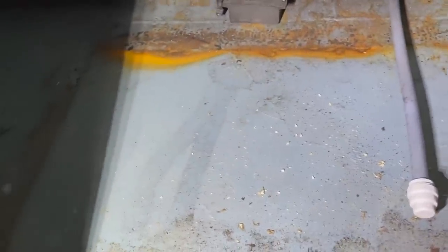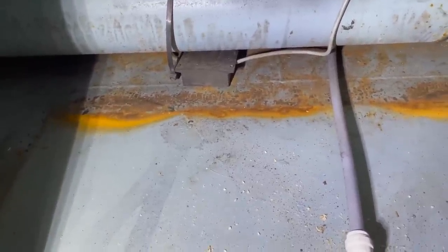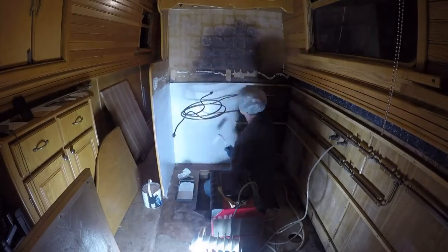Michael just took out the board and there's a little bit of rust down there and at the back there. So I'll give it a quick brush, then I can wipe it down and then just give it a quick coat of bilge paint, ready for tomorrow. I should mention that it's 6:30 at night and it's dark outside and I don't want to be doing this, but I'm going to. I didn't actually end up painting the bilge because I realised that I needed to treat the rust spots first. I used a rust converter under the well deck, but I was far too tired to film any of it. I then ended up cleaning and painting the inside of what will be the kitchen units to give us a clean surface to mount the new plumbing on.